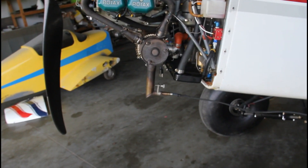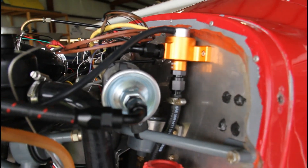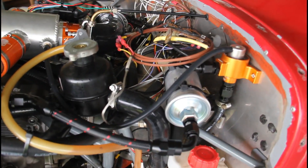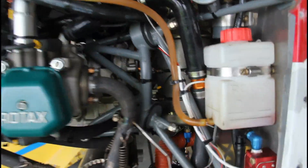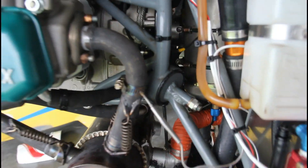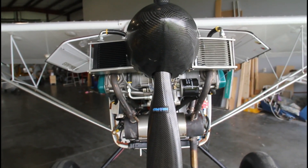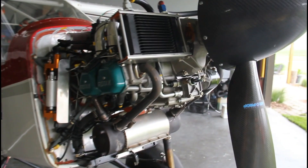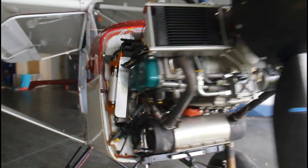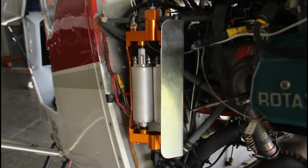We've got this pretty much ready to fly. Put it outside, got my O2 stinger probe in, did some ground runs, ready to go up in the air — unload the prop a little at higher RPMs, make sure our mixtures are good. We've got our pressure regulator, post high-pressure filter, coolant bottle relocated, the plenum is in. We weren't able to fit the 15-amp secondary alternator — not enough room with the tank. The secondary oil cooler is installed, and since the manual pump was removed we could fit it. He was heating up in hot temperatures, so that should really help in those hotter climates.